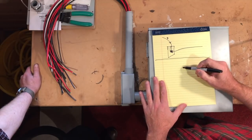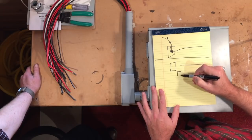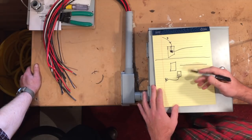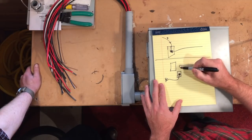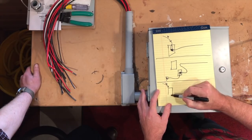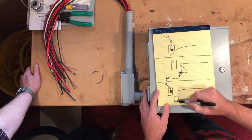I'm going to draw those right now because that's significant for a discussion later. Connecting to one of these wires is a circuit breaker that has a switch on it, and that's what you connect if you've got a circuit into your house — whether it's outlets, lights, whatever — that wire comes into your box, connects into that circuit breaker, and that's your on-off switch. That's your normal house. Now what we're going to do is put a generator on there. We're going to install this transfer switch.